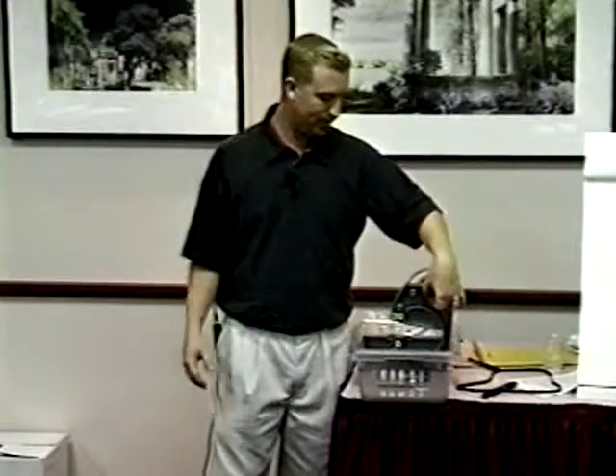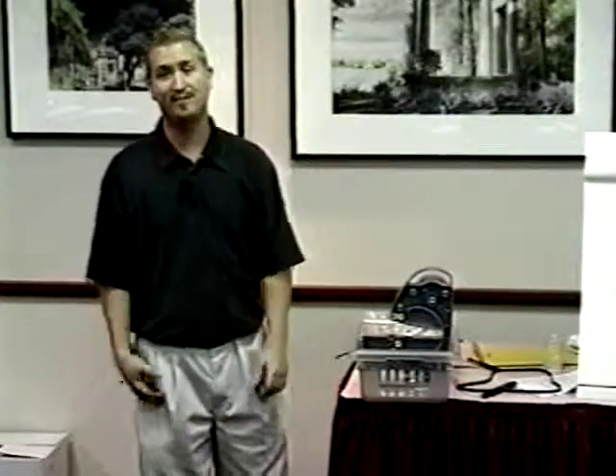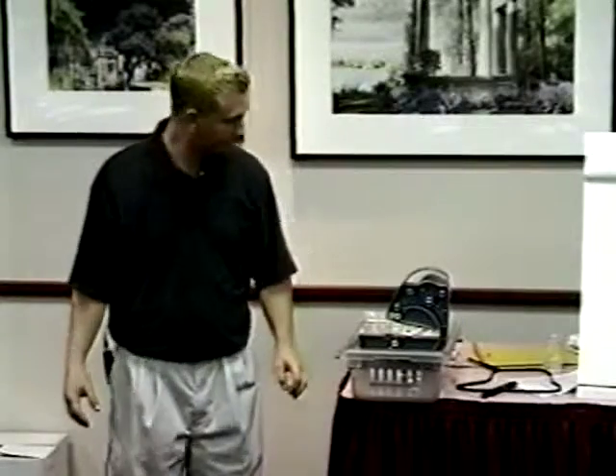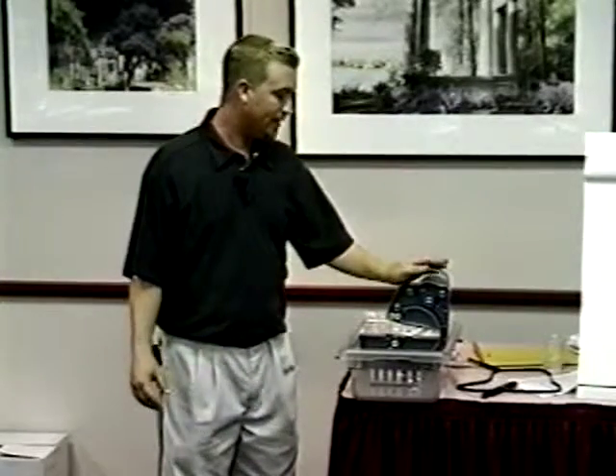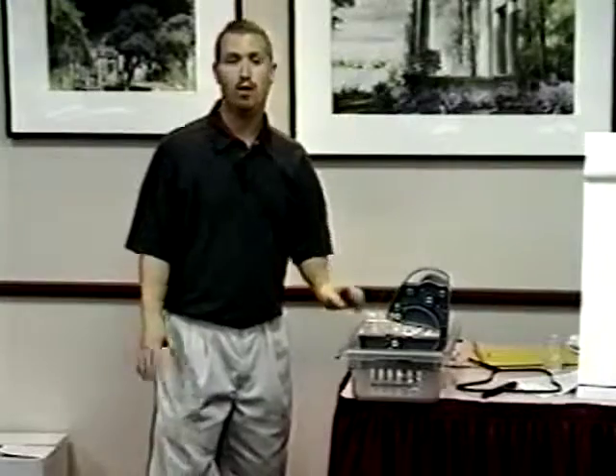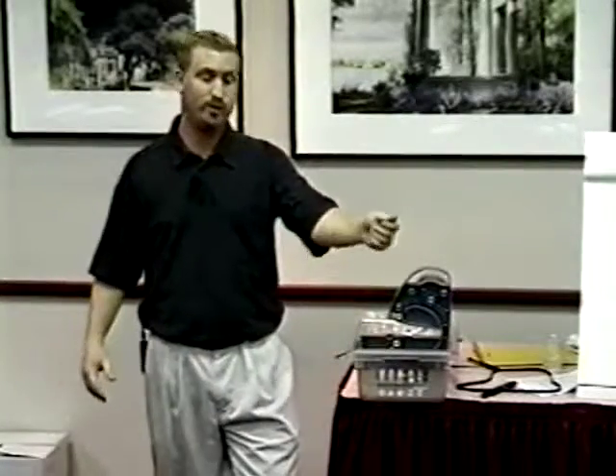An eight or nine is also something you want to deal with — I've seen saws melted down to where there's no raceway, just a glob of stuff. So let's address tight tension. Say your saw is aligned perfectly, the motor's parallel, everything's great, and you sell it to a customer. The customer calls up and says they ran it for 10-15 minutes and it's really, really hot — they had to pull the plug because it's so hot and they're afraid to touch it.